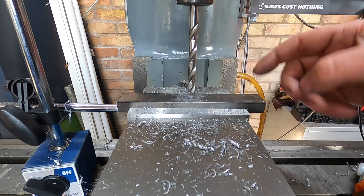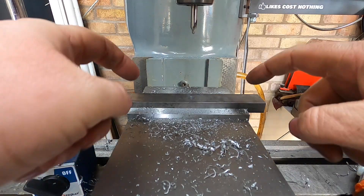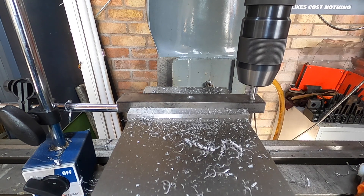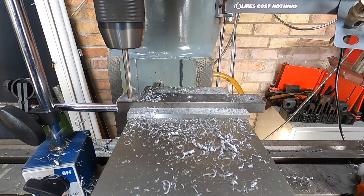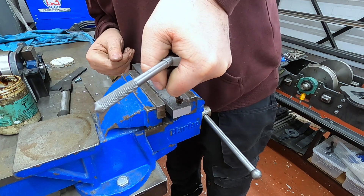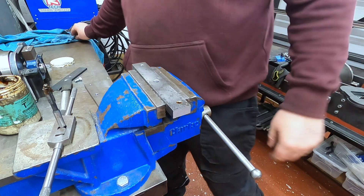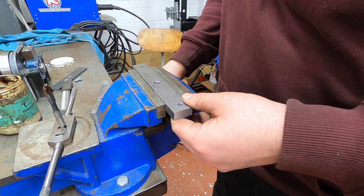So we'll do these other two. Now they are 2mm offset to this centre line and they're 135mm apart. Wrong size hole - I've ruined that. Right, try again. Some dozey plonk, I put the wrong size hole in.